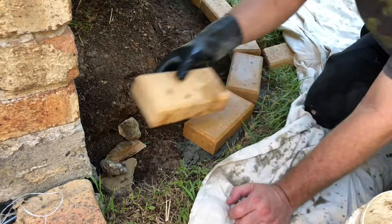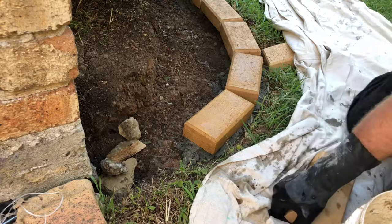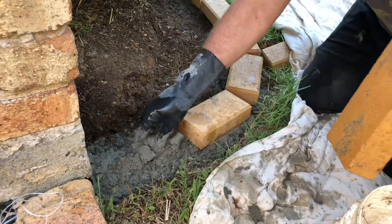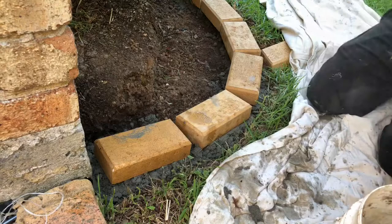There's also quite a big hole there because it's underneath a tap and it eroded quite a bit of soil away. I've put some rocks under there as well — you can see underneath the paver there's a couple of rocks. Rather than using straight mortar I've used a couple of rocks, but I'll put mortar around those rocks so they're all embedded. That way you're not wasting too much mortar and it also makes it a bit stronger.